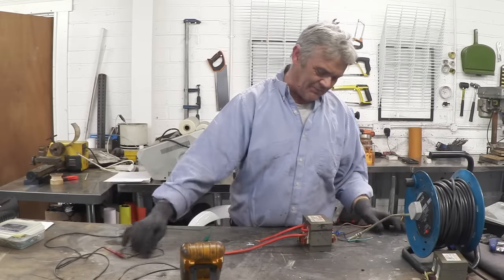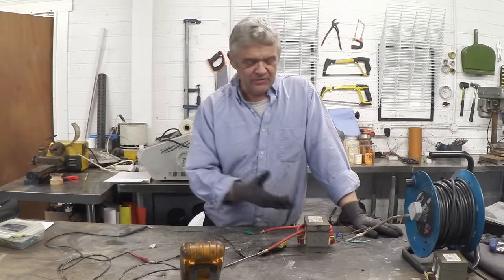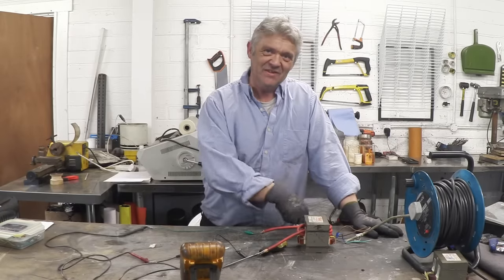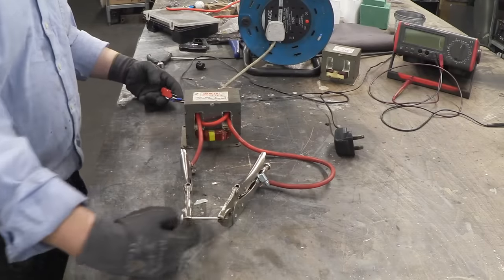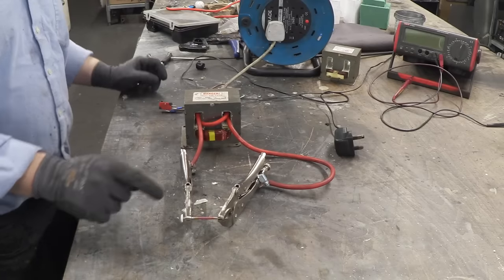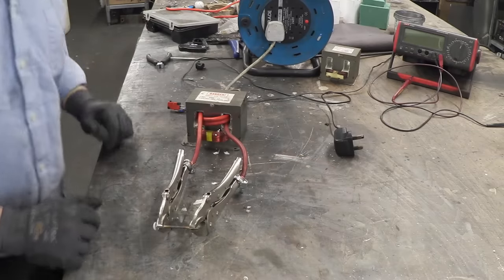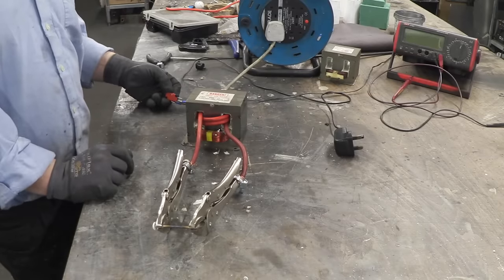So that's not going to do much, but remember this is a UK 230V supply and we're getting 0.9 of a volt. If we rewire to put another turn in, we get 2.2 volts — the voltage goes up because there are more turns, meaning the ratio is going down. Now with two locking pliers on a single turn and a stainless steel nail between them, you can see it starting to get hot, but it took quite a long time. Let's put two turns on — rejigged with an extra turn, hit that power, it starts to smoke and this time we can get it really hot.